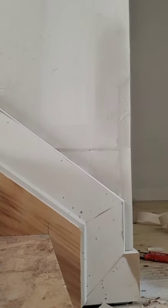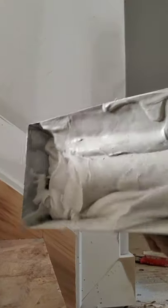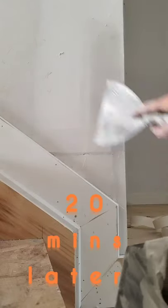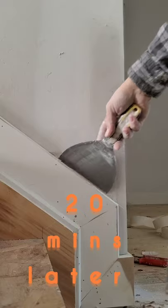That's a taper's worst. A taper doesn't like that. A drywall finisher doesn't want chunks in his mud. You rinse that out, you dump this water, you don't use that. It's poison now. All right, so once your mud's mixed, not too soupy, but just so it rolls off your knife, clean up your little bits of mud that might get chunky.